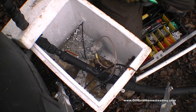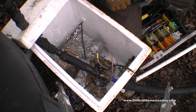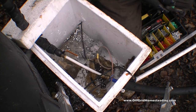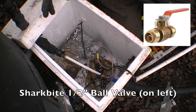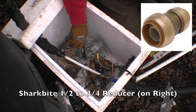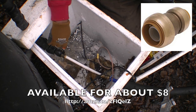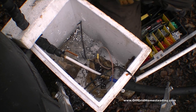So what you see in here — I've got my PEX coming in to this point right here. I'd really like to go from three-quarter right to the opening on the output there, but this has already run, it's already in the box, and this has not broken, so I think we're going to be pretty safe. This is my release valve — it actually holds the water from the top of the hill down here so that if I'm working on the pump I can shut this off and work on it without getting back-sprayed.